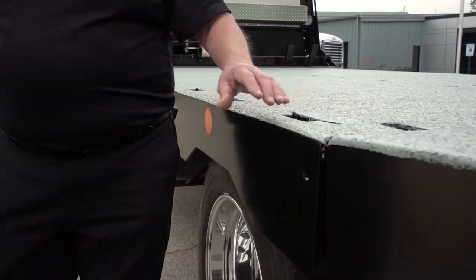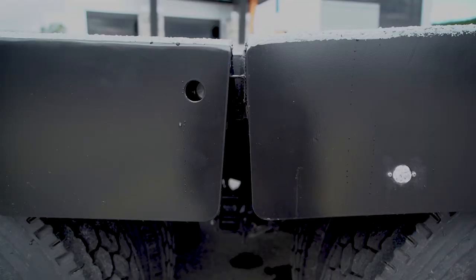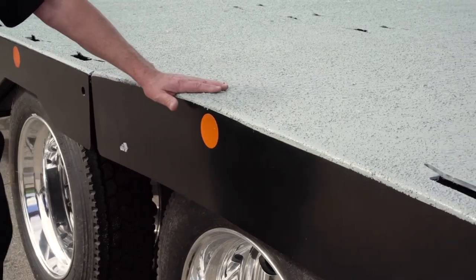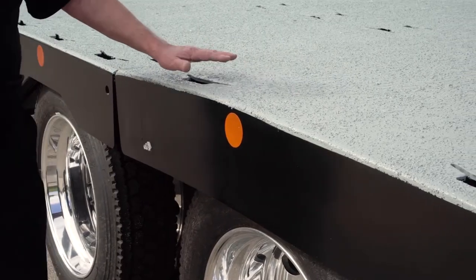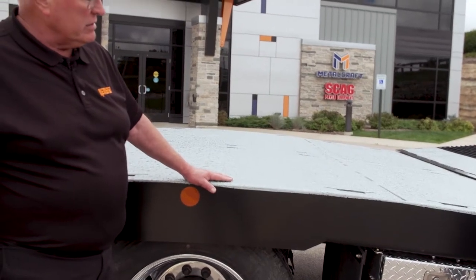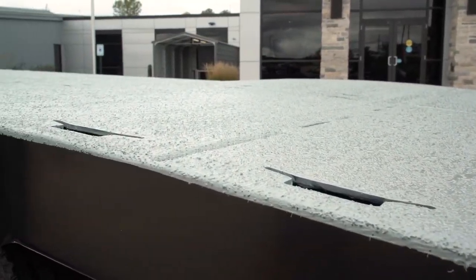The mechanics of the deck are very simple — it's hinged forward of the axle. The advantage is that it reduces the overall length of the truck while still providing a very low load angle. The rear deck also has a curved shape, which allows loading very low ground clearance equipment without raising the rear deck to clear the hinge line. It also aids in loading tracked equipment — it can simply drive up over the curve without breaking over and slamming down onto the deck.